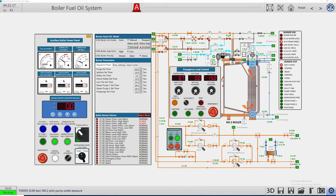Hello dear friends and welcome back again to Adventure Story Channel. In this part we will continue to set up our engine room. As you can see, we had a high pressure alarm and shutdown of the boiler — our safety system activated. We also have a high-high steam pressure burner shutdown indication.